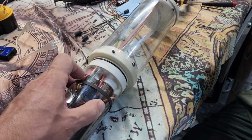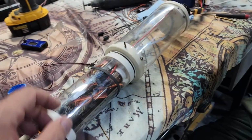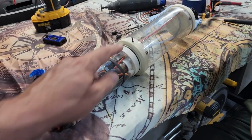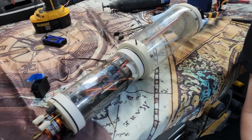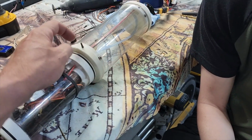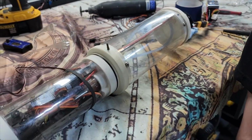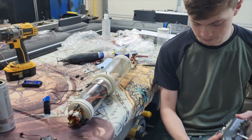Oh, it works. I'm just pressing it. Oh, and the pump. There you go. All right, cool. Yeah, I just find it kind of funny when you're pressing it like this and you see it go up and down so fast. And we tested the integrity of the vent. It's sealing properly. So the only time it lets the air out of the ballast chamber is when the vent stem is retracted, just like that. We are in good shape. Pack this sucker up and we are done.